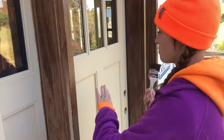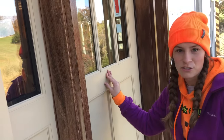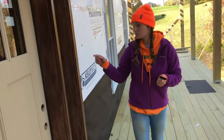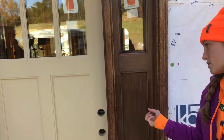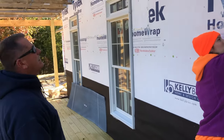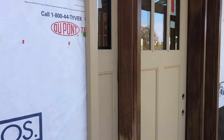I was actually going to do the door a little bit lighter, but I had to end up doing it darker because this front part that I'm staining now has a really smooth texture — it doesn't really absorb any of the stain, it just goes on top. But this part of the door is more of a matte finish whereas this is more of a satin finish. Where the matte finish is, it absorbs so much stain and it's really hard to get it really light. That's why the door ended up this dark.